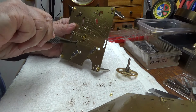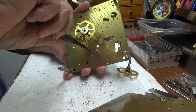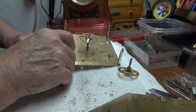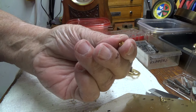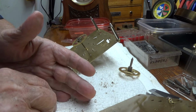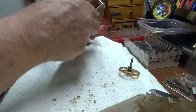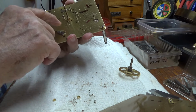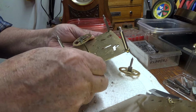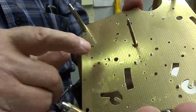And with the front plate, just remove that. It's okay, Molly. Then we're going to put in, here's the bushing, and here's another bushing, got both of them. We just want to make sure that the oil sink is to the outside. They should be pretty close, 1.5 millimeters. I'm just going to pound them in here. There's the bushing right there, and it's flat to the inside.